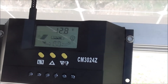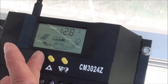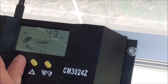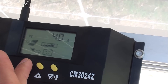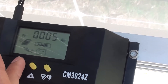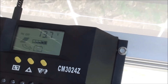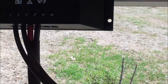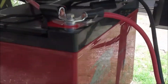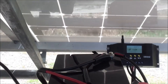All these are installed under the panel. Testing now: the sensor on the battery reads 30 degrees ambient, and it's charging at about four amps. The battery is now charged to about 13.7 volts. It's pretty easy — just follow the instructions. The battery is under the solar panel, sitting on the platform.